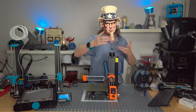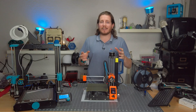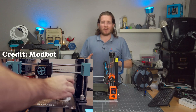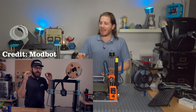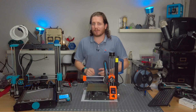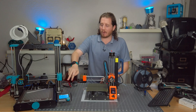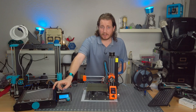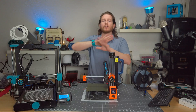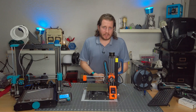That's where it's up to you to fix it. That involves axes leveling — utilizing something that is the same height. Modbot, a buddy of mine Daniel, did a great one where he used cans of soup to level out the X and Z axis on his Sovol. Soup cans are pretty much the same size as long as they're from the same brand. That's a great way to make sure your axes are perpendicular to the table and hopefully the plate itself. If it's still not right, redo your bed level. If you have to re-square your axes, you're going to have to redo your bed level.